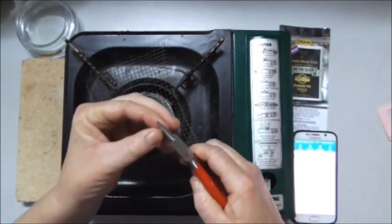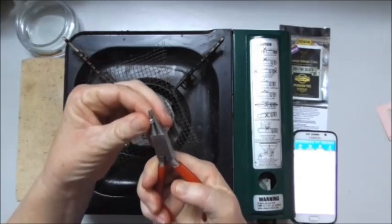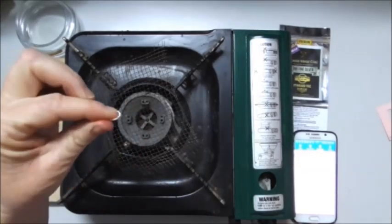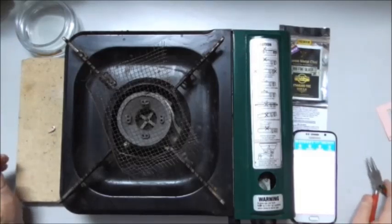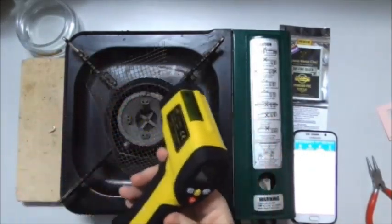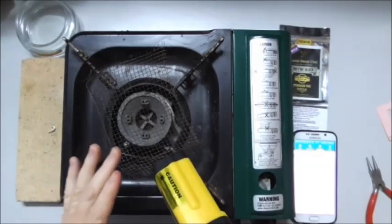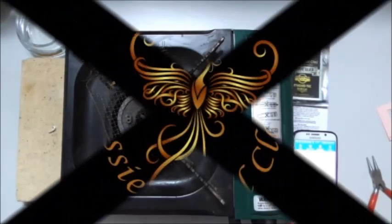After six minutes, I'm just going to bend that — grab it with your nose pliers, put your finger on it and just run it around nice and easy. There we go — a nice little bend on it. I could go more. Double check that you've got a good bend on it. Have fun, do your tests, and once you get your test pieces and understand the temperatures within your flame — as I said, if you're not going to get a kiln, grab one of those laser thermometers. They're reasonably inexpensive and that'll teach you what temperature you actually need. You pretty much won't get a melt or have many problems in the future. Have fun and I'll see you later!